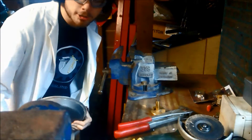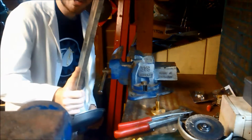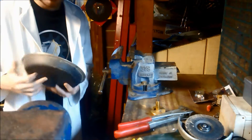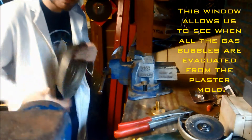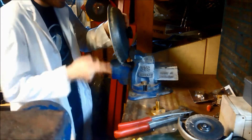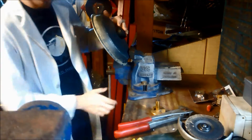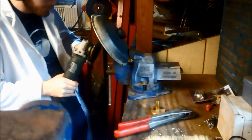This first part is optional — it depends on whether or not you want to see inside of the vacuum chamber. It does require some pretty thick plexiglass, or normal glass, or something. If you don't need to see inside your chamber, you can skip this. I'm going to take the lid and mount the window right in here. First, I'm going to fire up this little angle grinder and remove the pop rivet so that I can get this knob off — it's in the way.